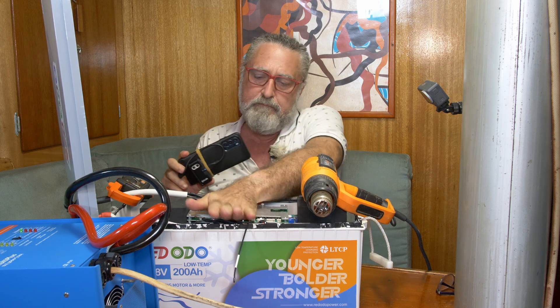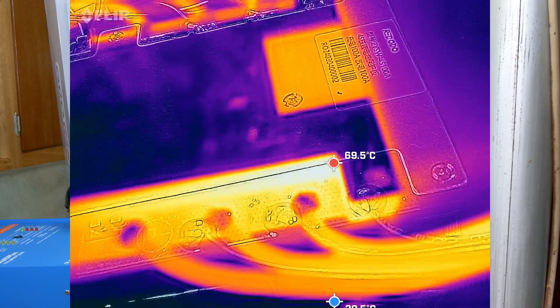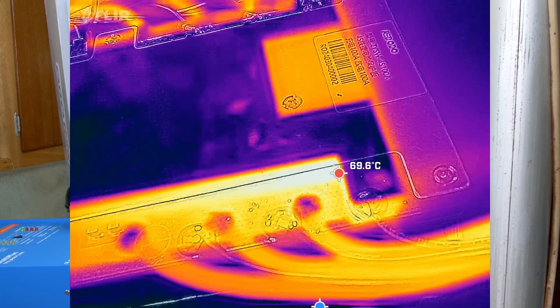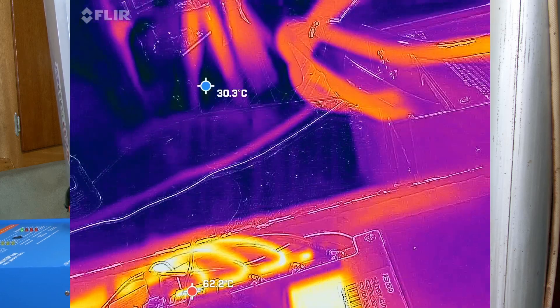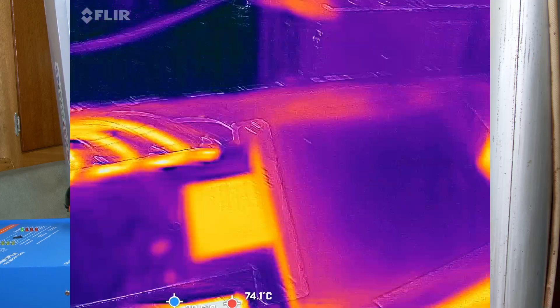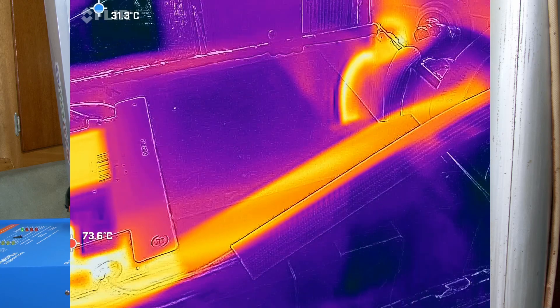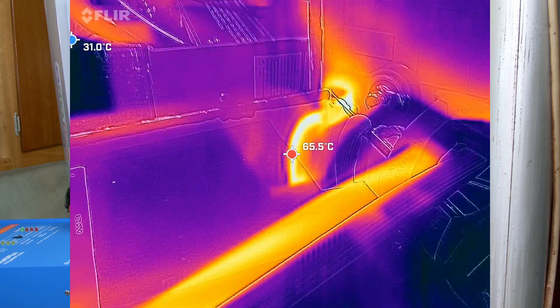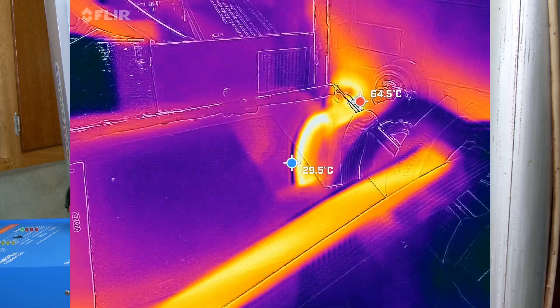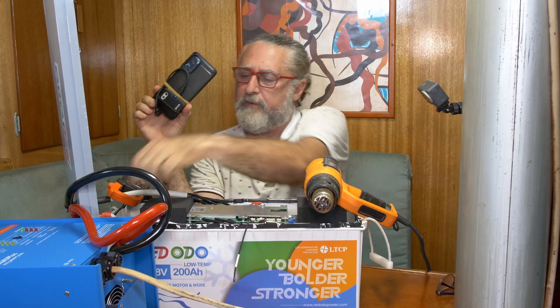Nothing is really hot — around 60 degrees, I'd guess. Let's take a look. In the hottest spot, it's 68 degrees inside the actual transistors. The wires are kind of the important thing — one is quite cool, the other is like 65 degrees.